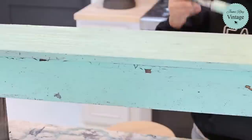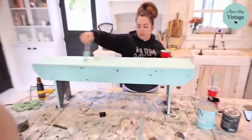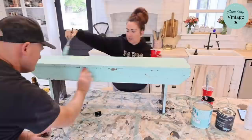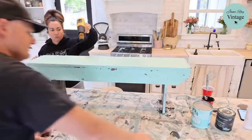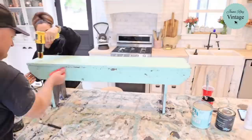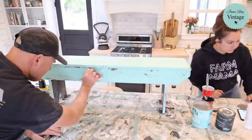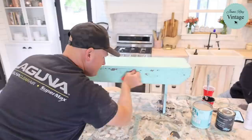When you're putting milk paint on, make sure the top coat used to separate the DIY from the milk paint is not all the way dry — when it's still slightly tacky that's where some of the magic happens. If you let it dry completely it'll still be okay but doesn't chip as dramatically. This type of finish is my favorite on corbels, but this bench is going to be really good too.